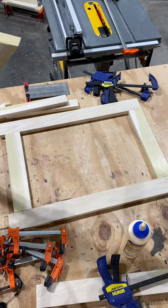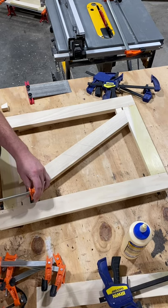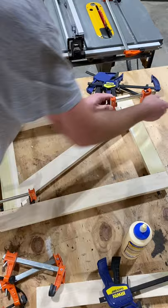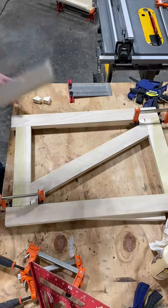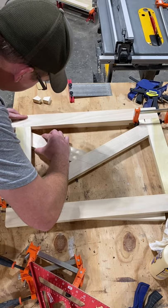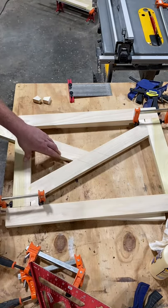Set it up on your scraps so you can work underneath it. Take your clamp, put it on top of the corner block, get some pressure going both ways, and clamp it down — you'll see it's pressing the glue out and everything is flush. I like to do one X piece at a time; it's more time consuming but more accurate for a better finished product. Line it up where you want it, trace your lines, and go cut it at the miter saw. You could cut this with a circular saw if you don't have a miter saw.